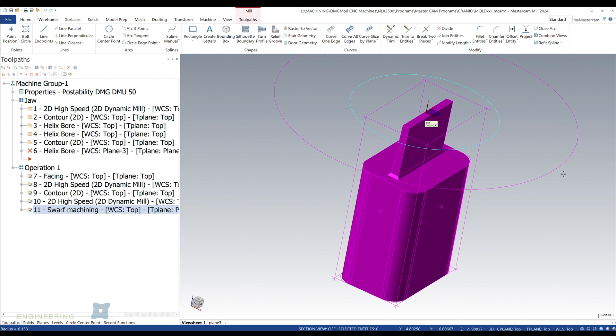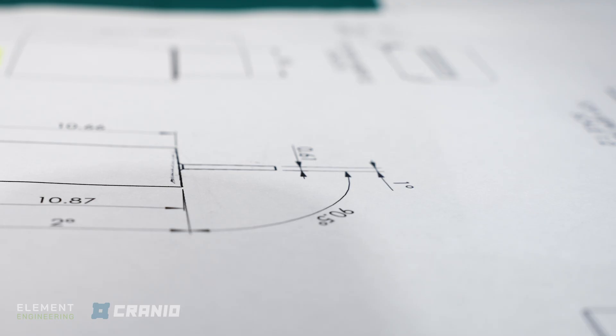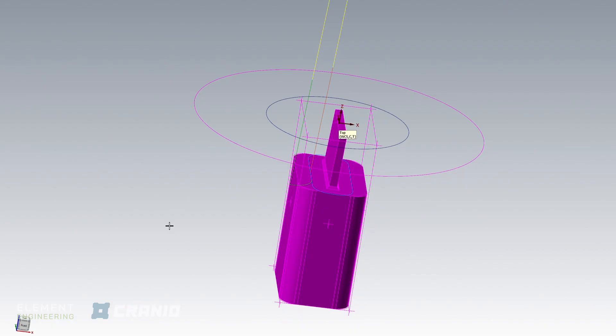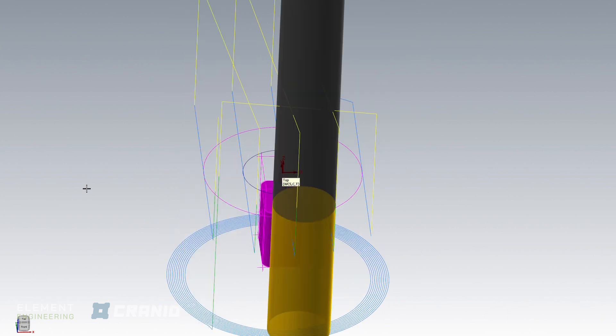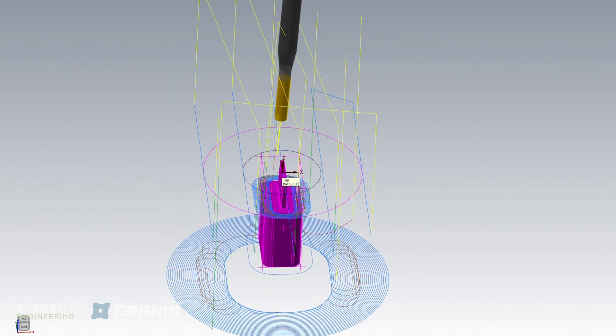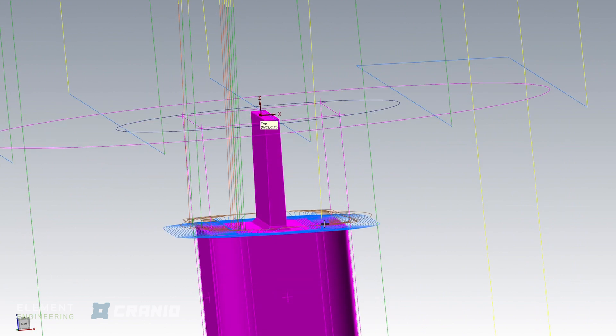This is the smallest part of the mould. To make the part we need to use the swarf milling function of Mastercam. So it's tilted at one degree — that's a really odd angle. I used a 2mm cutter to cut that profile. This is the whole process: the first pass was 10mm to rough it up, then use a 2mm to cut the whole thing. You need to tilt on a two degree angle on that surface and then swarf mill the wall with a one degree angle.